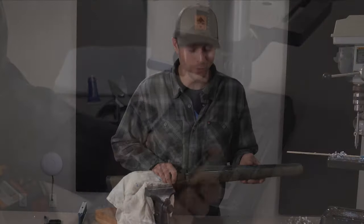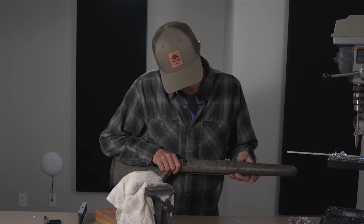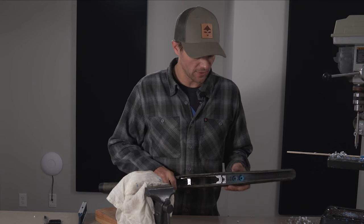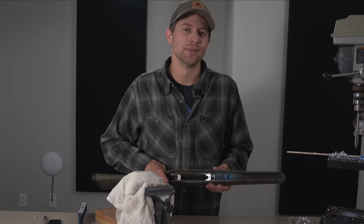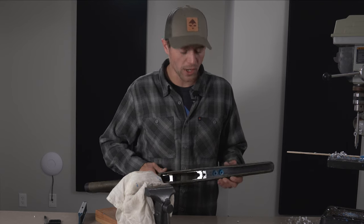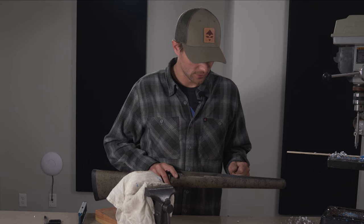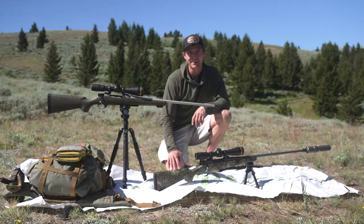A fun little side note: this gun had a layer of aluminum in the stock, so I had to countersink through that aluminum and then get back to the plastic or polymer to be able to get that T-nut to set in there right. Just so you know, some guns have aluminum in the stock, so depending on what kind of material — aluminum, plastic, composite, or wood — that might affect the ability to countersink into the stock to set those T-nuts. But I was able to get through that layer of aluminum so it works fine.